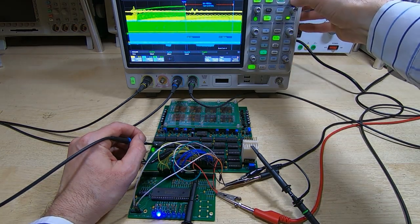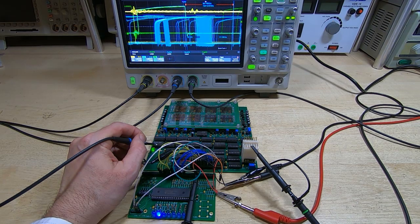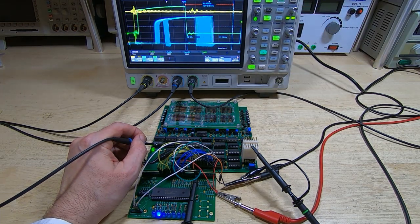and made very reliable. And this technique actually works extremely well if you're repairing old vintage computer equipment and you're having intermittent faults. Then looking at certain signal lines using a technique like this will really show up any failing parts, even if they appear to be working for the most part. This is a very good way of looking at the quality of signals over time, rather than just instantaneous values which may not show anything.